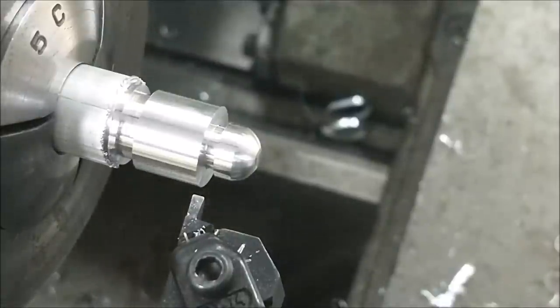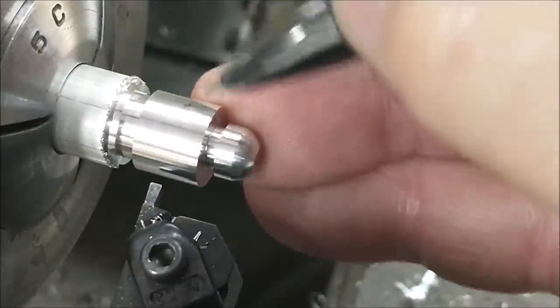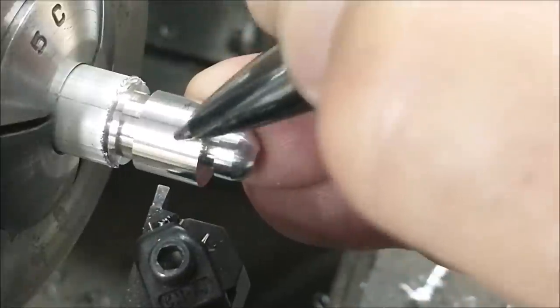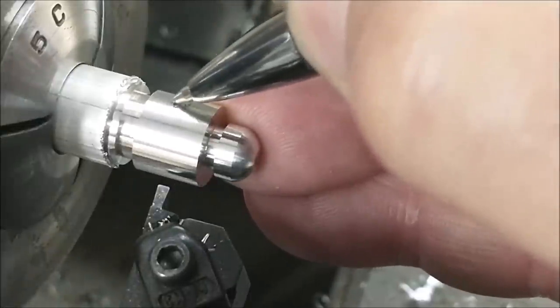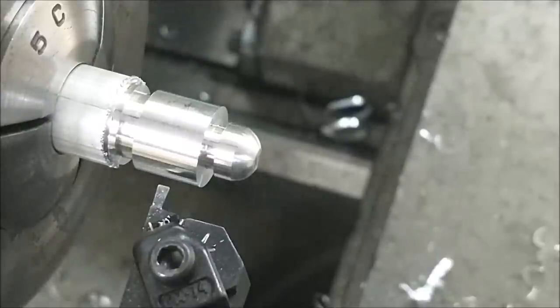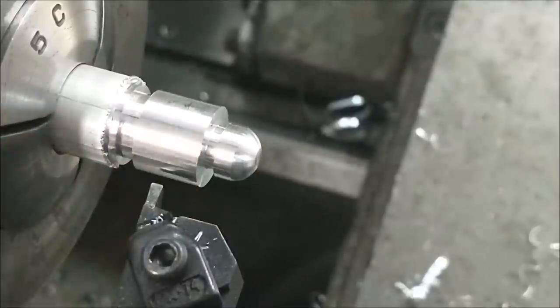I know that the number that I established previously is the backside of the groove. So whatever the width of the groove is, well, we're just going to have to make a small carriage shift to establish the width. But we don't want to go any further than the initial reading that we established. And this will make sense in a second. We're going to 779 on the dial because that's what was established early on. That is the finished backside dimension on the print.